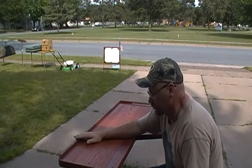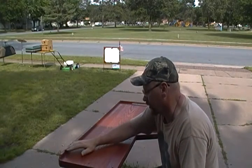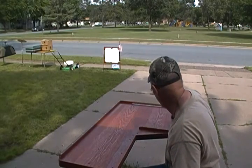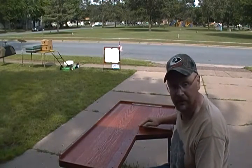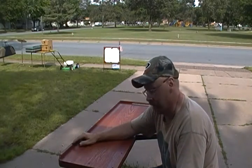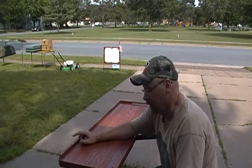And then the square railing is 5/8 inch square doweling, which is pine. And what I did is I pre-drilled holes all around on each piece I needed to complete around the bench, and then I screwed it down with a number 10 wood screw. Pre-drilling just eliminates any cracking, and that worked out really good.